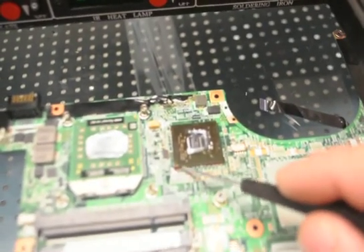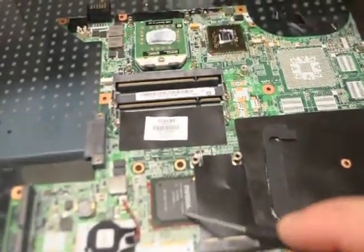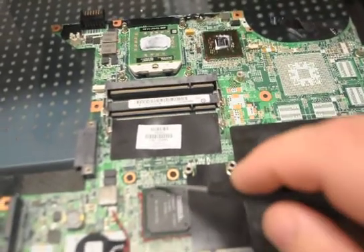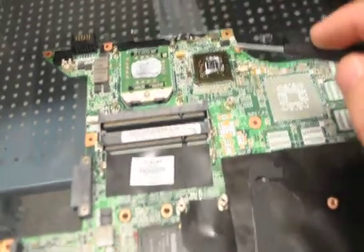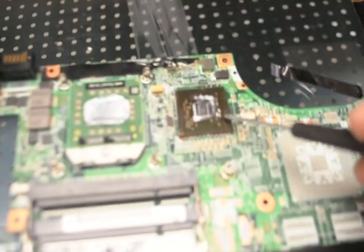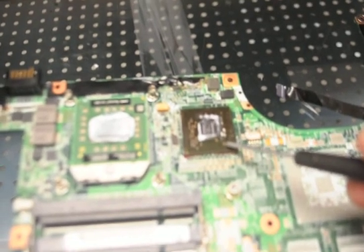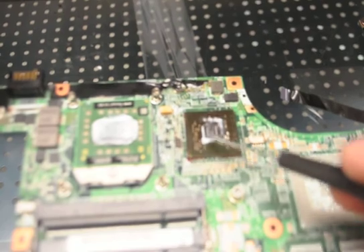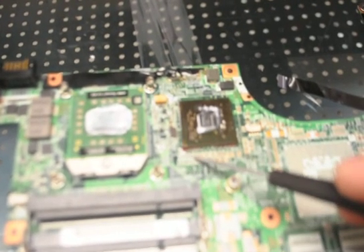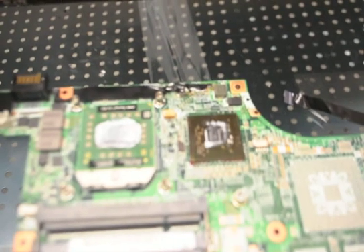The discoloration and actual separating of the chip means it's going to have to be taken off and re-balled. You can tell no one did the reflow correctly because the letters are still white on the good chipset — white letters, relatively good looking, and the green is still green. Where this damaged one is brown, that tells you it was heated up. There's actually solder right here — traces of solder being pulled. Those pulled solder traces mean these capacitors were actually blown off the board. These right here are capacitors and resistors, and any one of those could have been blown off.